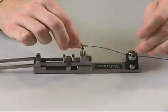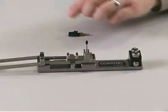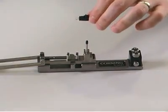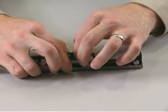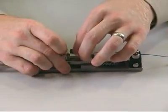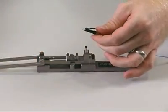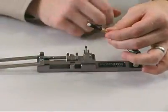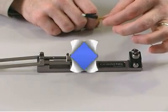The same steps are also true when installing a new Unicam LC connector without the continuity test set. Leave both dust caps in place, place the connector into the tool, and proceed with the installation as usual. Once the installation of the connector is complete, remove the black load adapter dust cap and discard it. If you are immediately installing the connector into a panel, remove the clear ferrule end dust cap. Otherwise, leave it in place.